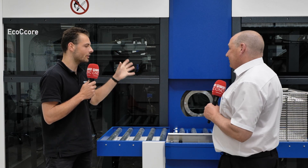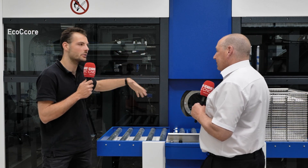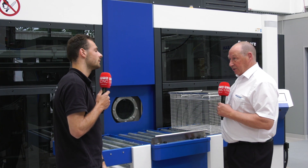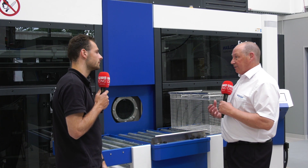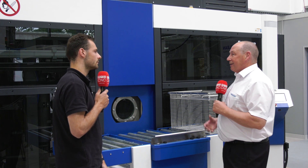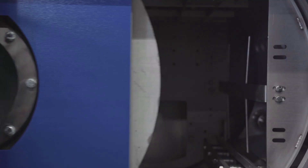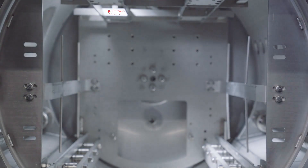How do you make sure the parts are held securely inside the basket while they're rotating? Importantly, not all parts should rotate. If you've got sensitive parts which may be bruised if they bash against each other, then you make some sort of fixture — like a toast rack — to hold a component in a specific position. If you don't hold it still, you can oscillate, interval oscillate, or fully rotate.